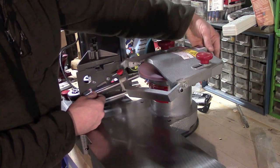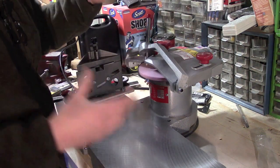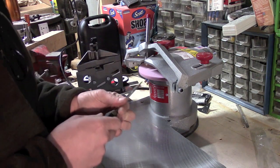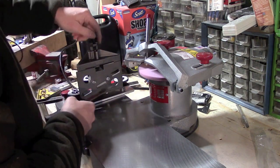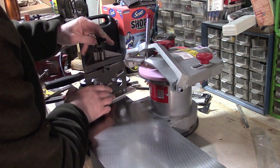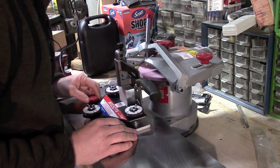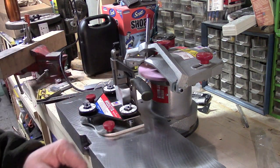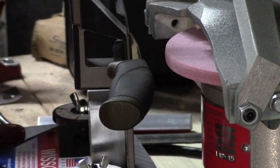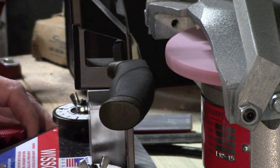There's a diamond cutter here to dress the wheel, so now this grinding wheel has been freshly dressed and it's got a nice concave on it — right now it's at 5/8. What I'm going to do is instead of a skate blade, I'm going to put my knife blade in here just like so and basically grind a little concave onto the spine of the blade. I believe I can do this without causing any damage to my sharpener. Safety glasses on, knife locked down — now we're just going to start grinding our concave into here.